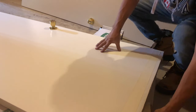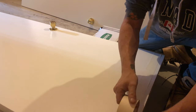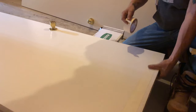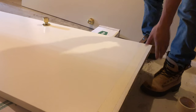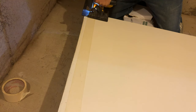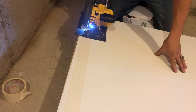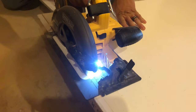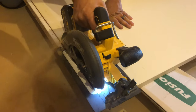I'm going to show you guys cutting a door. Those doors have been around since the 70s. You've got to put a little tape around there to prevent splintering. I've got my DeWalt — my favorite saw in the whole wide world, 60 volt, I love it. The tape obviously helps with the splintering. We're carpet installers, not professional door cutters, but they needed the door cut for the sale, so we just took care of it.